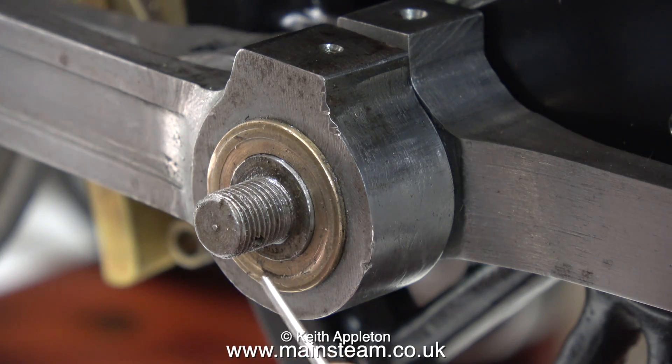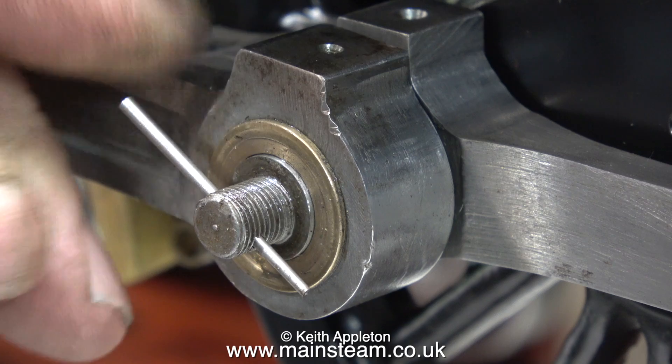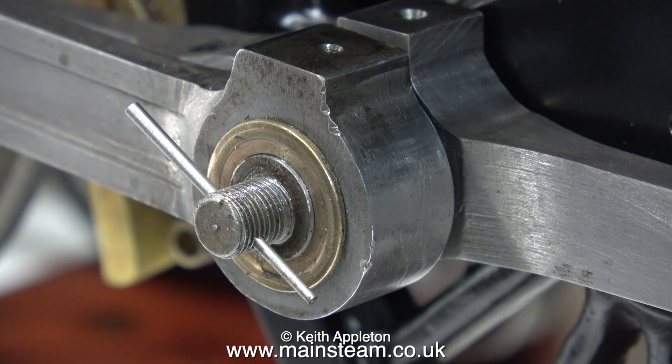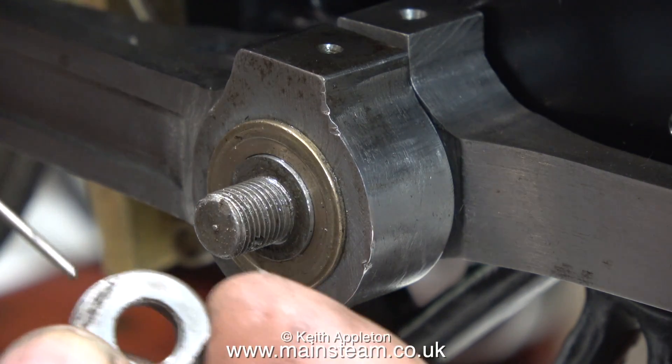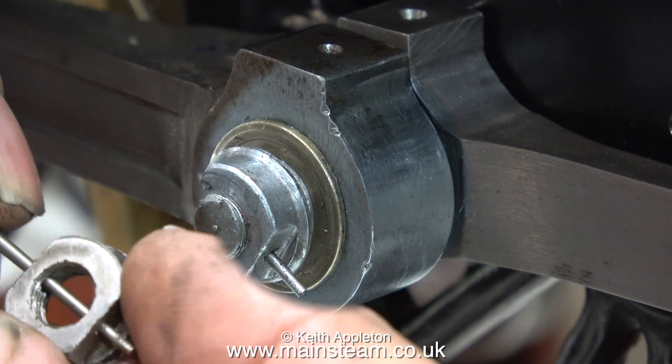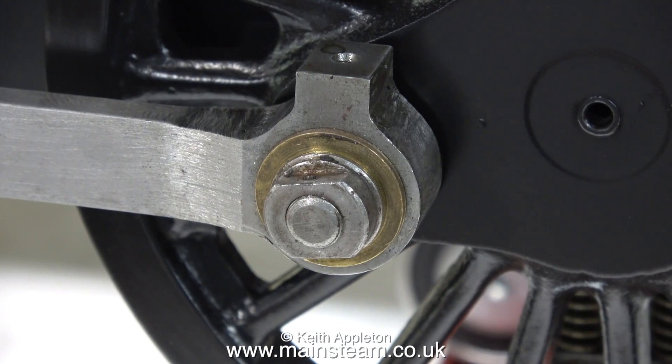The first thing I'm going to do is to fit some new taper pins, and here they are. I'm just checking which side they fit — it fits this way. It's a tapered pin in a tapered hole. When I commence final assembly of these parts, I'm going to make some special washers, and these washers will limit the travel of the side rods. As you can see, there's a big gap between the position of where the nuts are and the actual side rod bush.